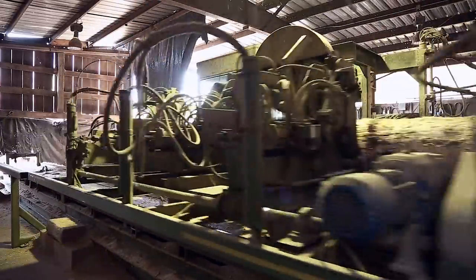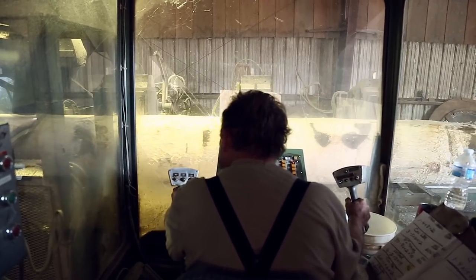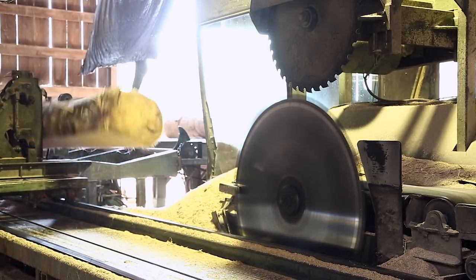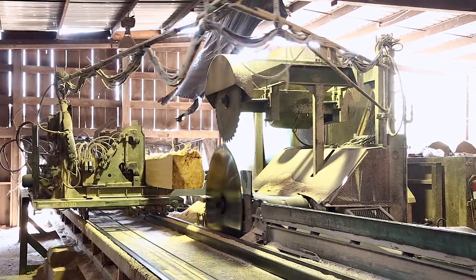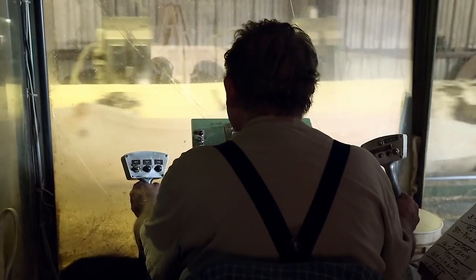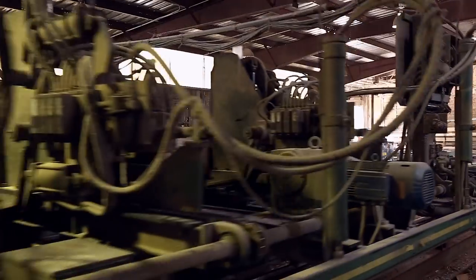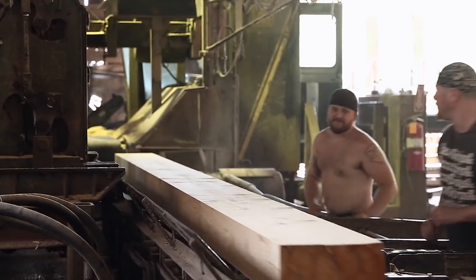One is cutting a horizontal cut and the other a vertical cut. This mill is very sophisticated — much more than you might think. It's a take-off of an old type where you had a big lever and clutch to make the log move back and forth. On this one, all the dogging, rolling of the log, and shimming is done from inside that booth with a massive amount of controls. This mill handles all kinds of cutting operations: large timbers for buildings, pallet lumber, dimensional lumber, furniture-grade material that goes into kilns. Every kind of lumber comes out of this mill, and fast.